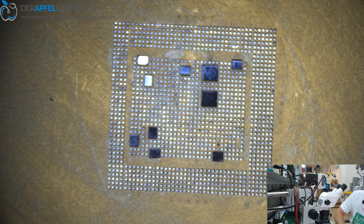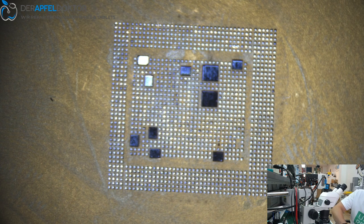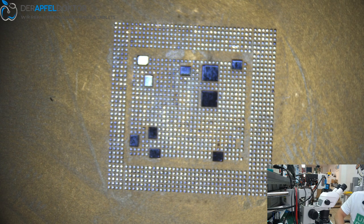Just wait some seconds. Took the paste fresh out of the bottle. It's important that the paste is not too dry and not too oily. We have to reach the right point. If you get this, you can take the paste right into the stencil and do the reball.